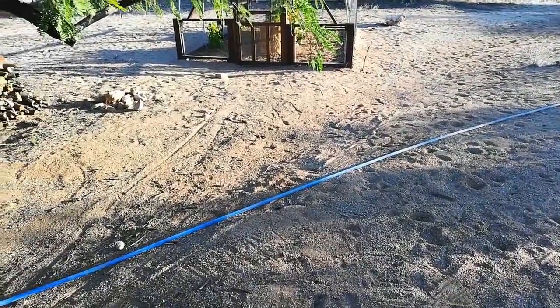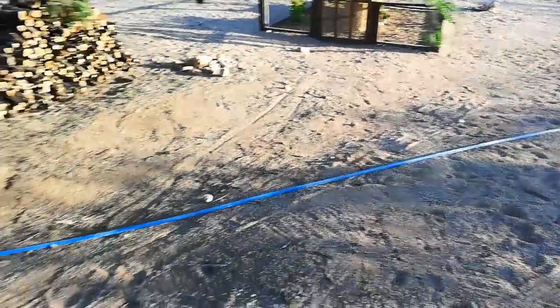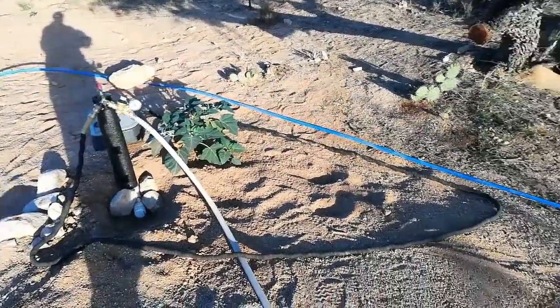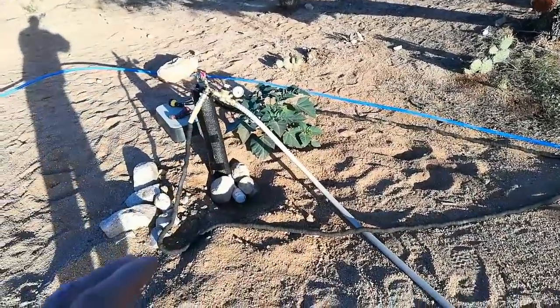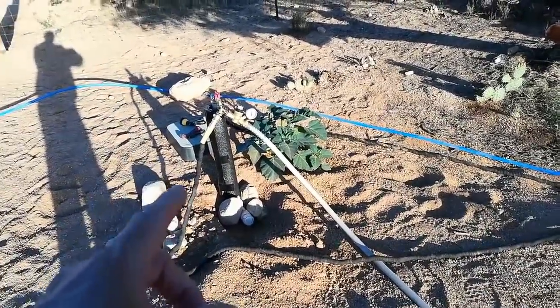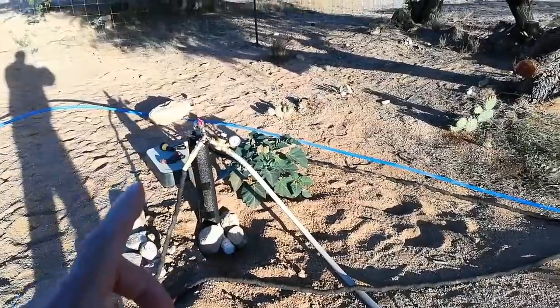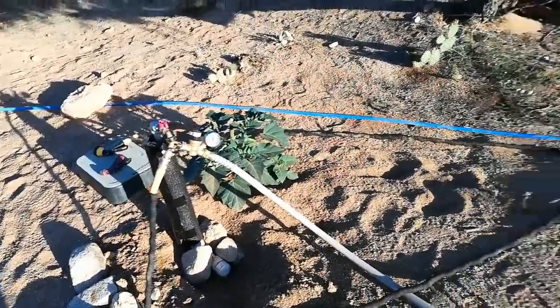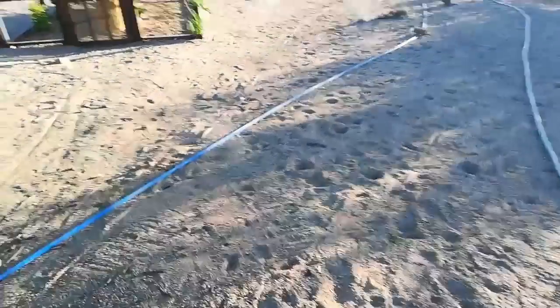We're using PEX because I was able to get a pretty decent price on a 300-foot roll. PEX is certainly capable of being used outdoors if buried, and the nice thing is we're going to have about a 150-foot run of pipe with no connections on it. So if there's ever any leaking going on — besides someone digging into it — any mechanical leaks would only be right here at the source or at the termination.